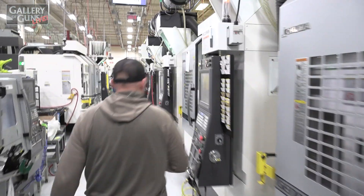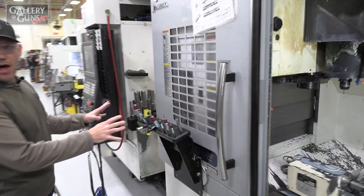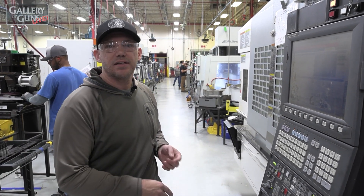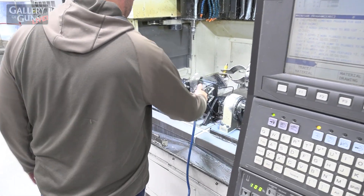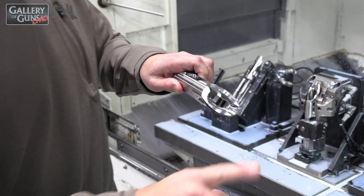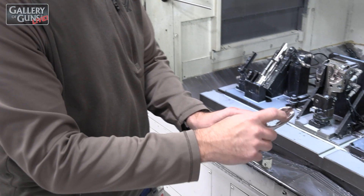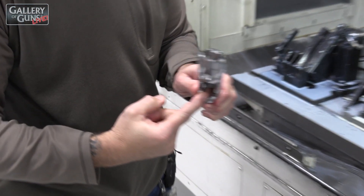After we're done with OP50, we do all of our quality checks and then we get to OP6080. OP6080 is the same as Gen1 — we've got the new tang cut implemented and a couple other cuts. We do a tang cut, finishing the tang and putting some chamfers on it. We do this little relief cut right here, and then we cut the feed ramp.